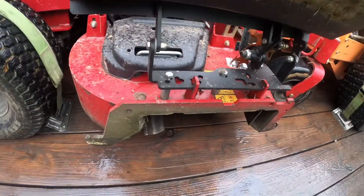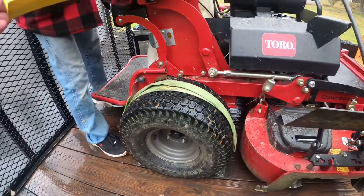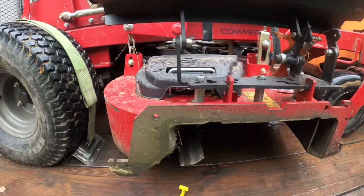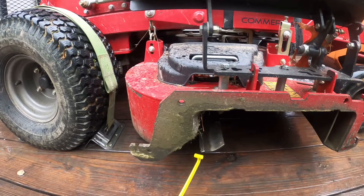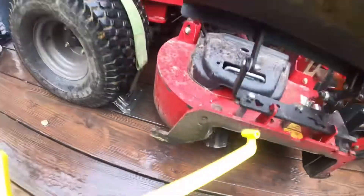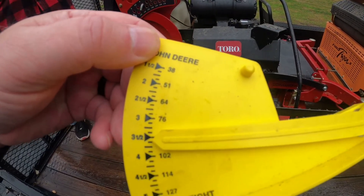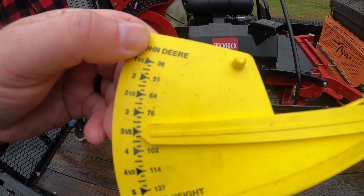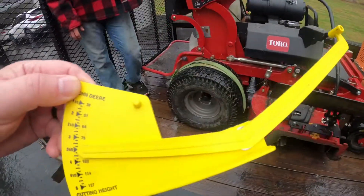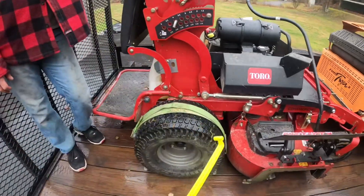And on this one, I'm going to say you're a quarter inch lower than 3. We'll put it at 4 and show you what this does. We do a whole lot of yards at 4 — we're really at 3 and three-quarter at the 4 setting. We're dead on it. And you're in between 3 and a half, almost 3 and three-quarter — closer to 3 and a half. So you're a half inch lower than what the setting is showing on this one.